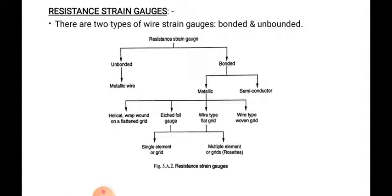As we apply the downward force, the rod will get elongated by a certain amount, meaning there will be some deflection or deformation in that metallic bar. That is nothing but the strain. The strain is because the force is applied perpendicular to the cross section of the cylindrical bar, and because of that downward tensile force the deformation takes place. That deformation is the change in length, and the change in length upon the original length of the bar is the strain of that metallic bar.